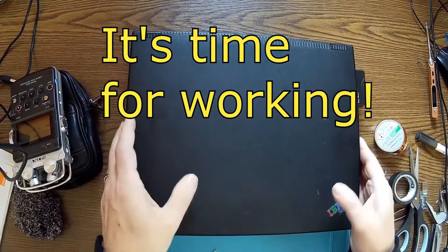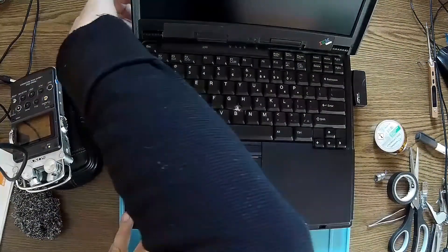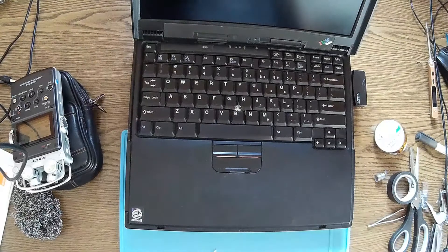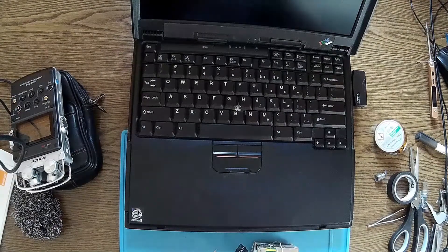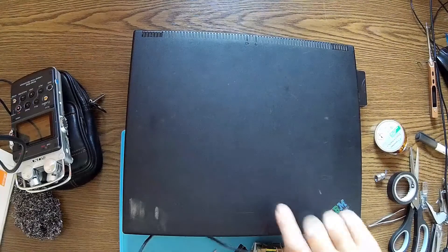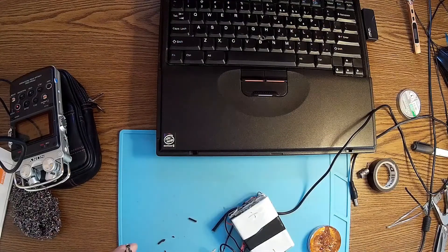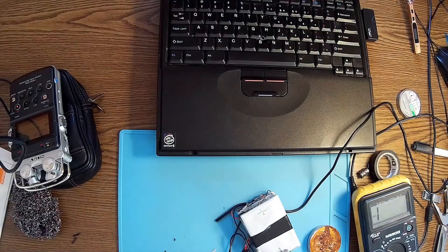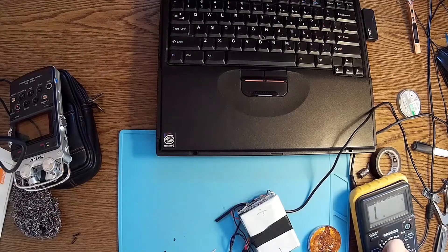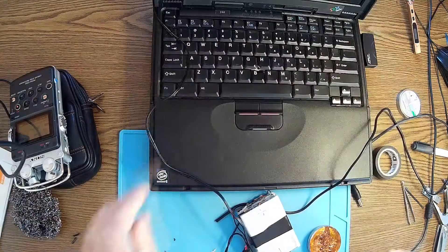If you remember my other tutorial about this old IBM — this one doesn't have any battery, nothing at all. So we can use this pack to start it up, let's see if it's working. I think the power supply connector is here somewhere. We can have multiple cables with multiple shapes or heads. Now let's check the voltage — very important, we don't need any mistakes. That should be plus in the middle, and we have plus in the middle. Let's see if it's starting.